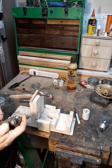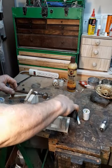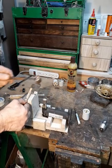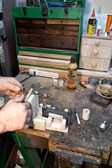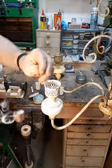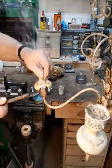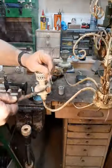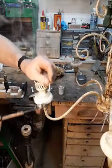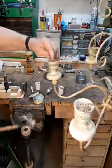If there were only one wire to solder, I'd use a soldering gun, but for doing an entire chandelier, we have this little stove, which will heat up a small pot of solder, and we'll dip all the wires. And that's it.